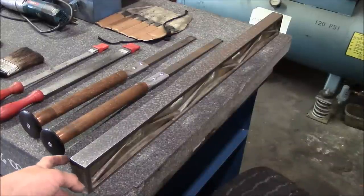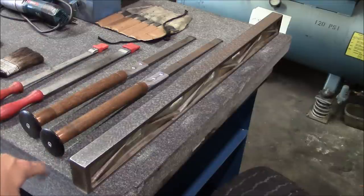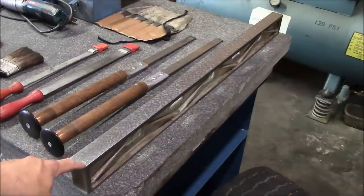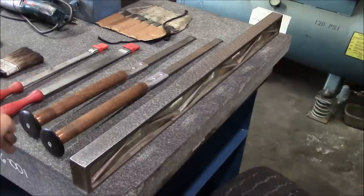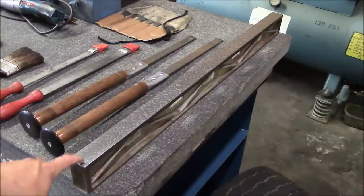And this is my straight edge - that's made by Bush. It's cast iron, 36 inches long, I think an inch and a half wide. I like this one because it is parallel, so I can set it up on top of a dovetail way or whatever and indicate something on the other side. It's a little more versatile than the Camelback style.